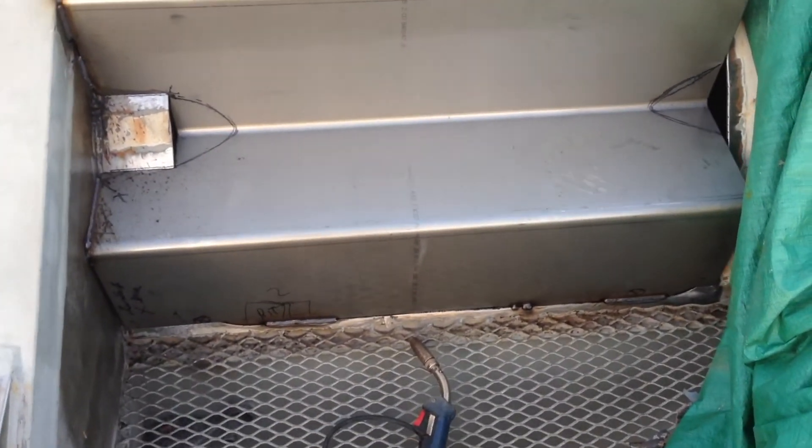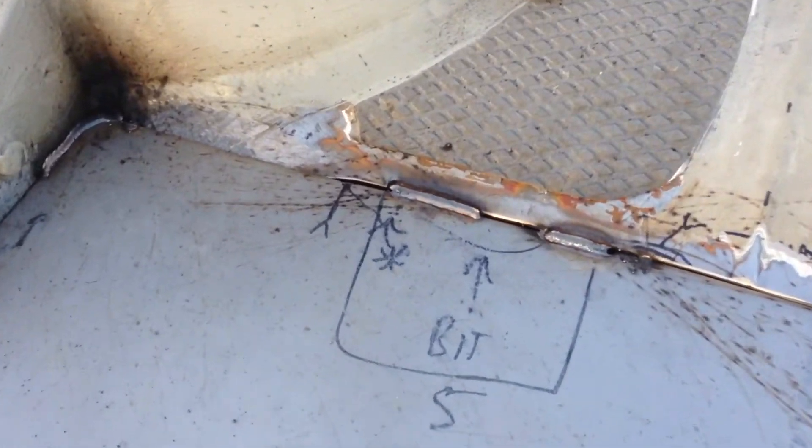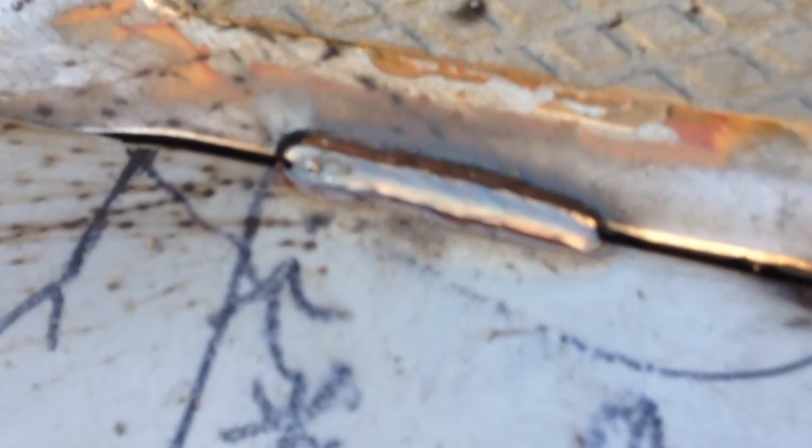Here I am welding in the steps after the first fit. It's a little bit difficult trying to get all the angles and geometry right, but here's my welds going in with a nice little bit of gap there, just so I can ensure that I get penetration between the joints. That's steel to stainless steel, so I've used 309 LSI wire.